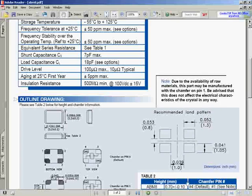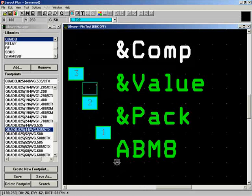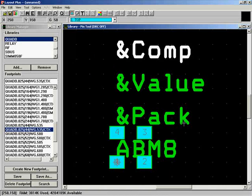We only have one pad and we need four, as shown in the datasheet. We can right-click and click New to drop additional pins. We now have four pads, but they jump around due to global spacing being set to about 50 mils. Trying to drag pads one mil at a time at this resolution is very frustrating. A much easier way is to go to the Tools menu, click Footprint, and select from spreadsheet.